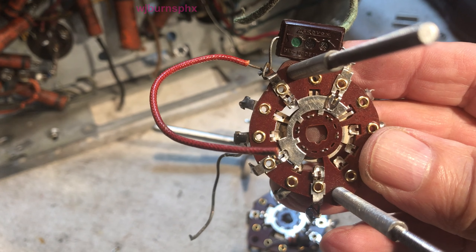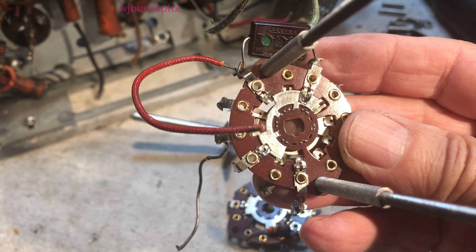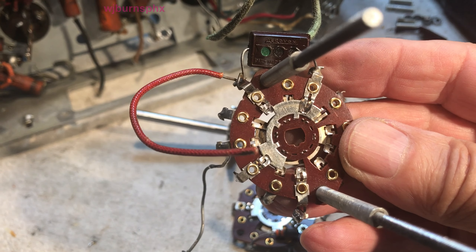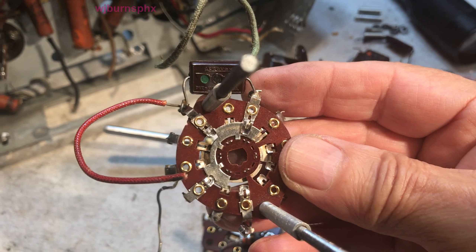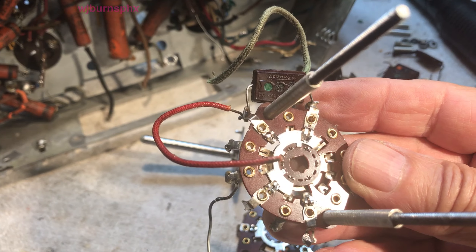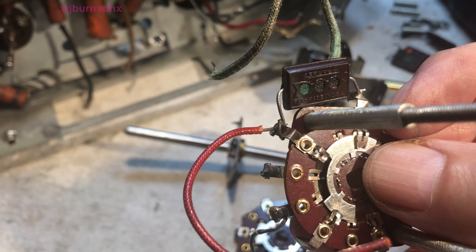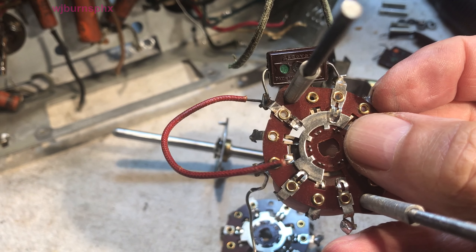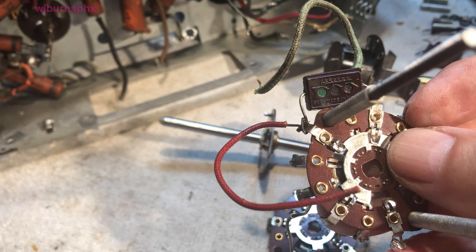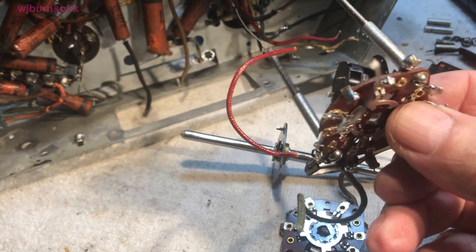This kind of wafer band switch seems to have a serious problem whenever you try to get the reception working well, if not great. Sometimes you can get in there and clean them with brushes or pipe cleaners real good, and try to get the little tangs on the contacts to the flat piece of brass or some alloy. But sometimes they don't clean up good enough because you can't get in there — you saw what a bag of snakes that was trying to get in there with something. This is the best way to get those things clean.